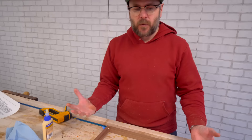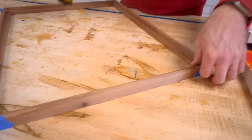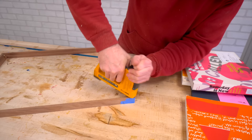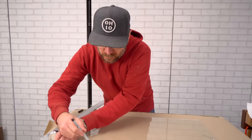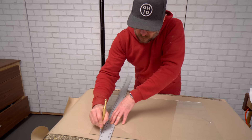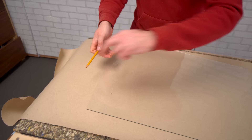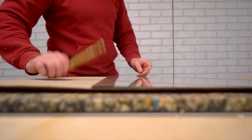Normally I would reinforce these joints with my spline jig, but we made this really thin, so there's not a lot of meat for the splines. So I'm going to take my staple gun and staple the corners. That's going to hold just fine for this frame. We're going to take a piece of glass and cut it to size. I just got this cheap little glass cutter — you score the glass, put a piece of pencil underneath there, and you break it. And that's going to fit.